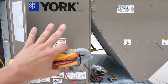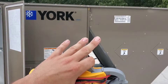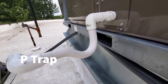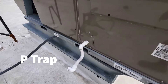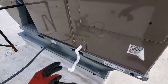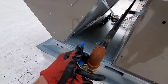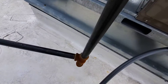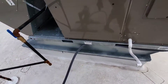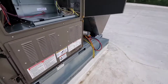Make sure that you check for noises. If you hear something weird, check it out — make sure a fan blade's not hitting anything. There's a trap here so that you're safe from having water come up on your coil or stay in your pan. You need to make sure you have a shut-off for your gas and also a drip leg. That way, any debris, water, or buildup will go into that trap instead of getting inside your gas valve.